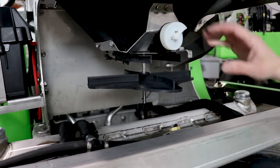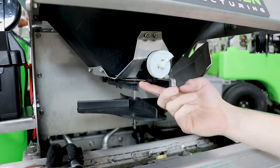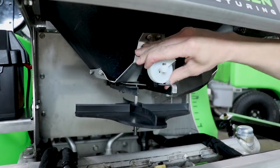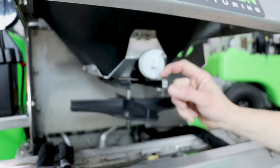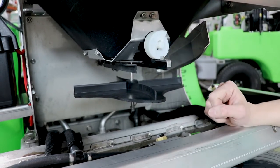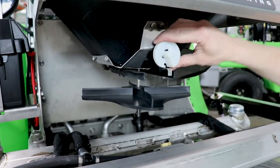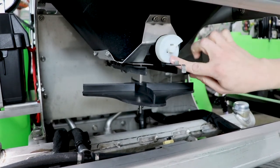Next we'll talk about a couple things at the front of the machine — the rate gate linkage, rate dial, and rate dial holder. These are popular items to keep on hand as spares since they can be bumped easily and are inexpensive. The dial operates by setting it in line: the lowest point of the dial is your setting, because the tab on your linkage backs up and hits the dial at whatever you want it set on. Be sure the slot running through the dial is not in line with your linkage, because it can get behind it and move on you — when you shut the hopper door it'll knock the dial off. Always make sure the linkage hits the face of the dial.